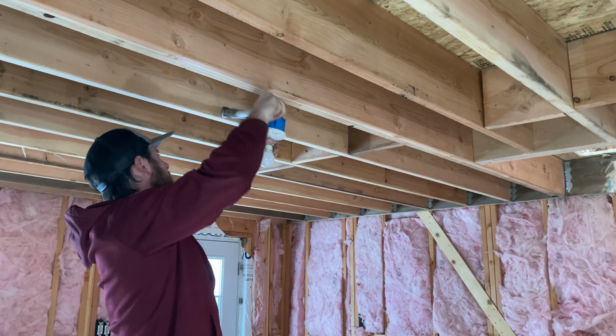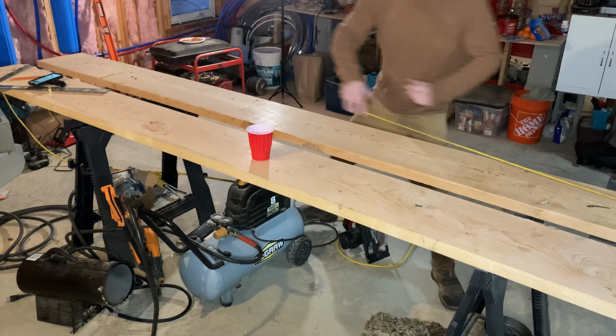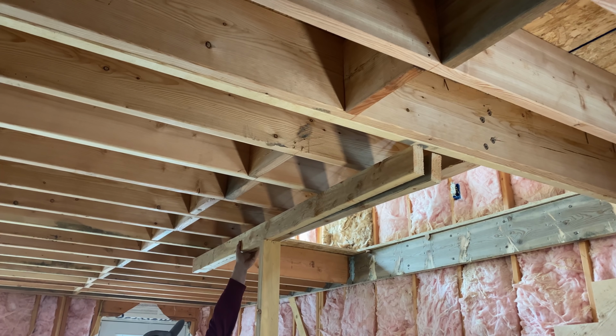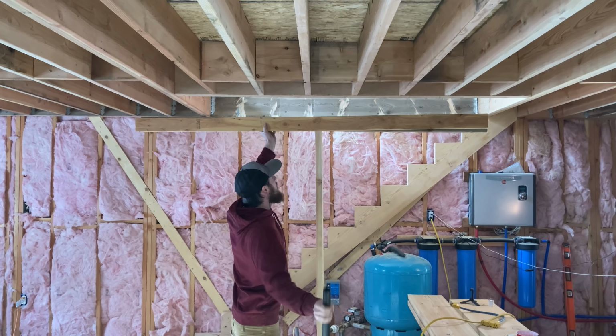We're up here in the loft today, and what we're doing today is fixing mistakes from yesterday. We have this sweet stair opening cut in the floor behind me, and we got a stair stringer lined up against the wall right there. If you go down those stairs right now, you are going to whack your head on a floor joist. So we're gonna cut out two more floor joists to give us a little bit more overhead.